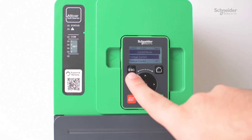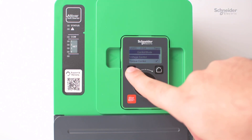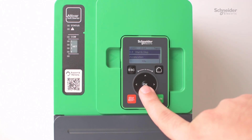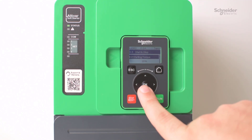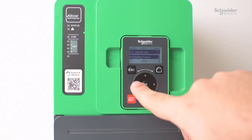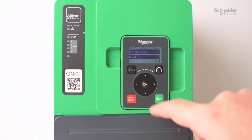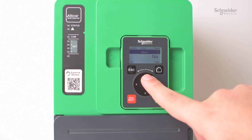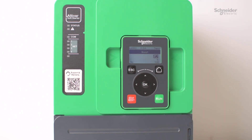Now, the default is torque control. With torque control, you have the ability to adjust the initial starting torque along with the boost value. Initial starting torque is a value where you can adjust the amount of torque applied at initial start, while the boost value is the amount of voltage you apply at initial start as well, so they kind of work hand in hand.